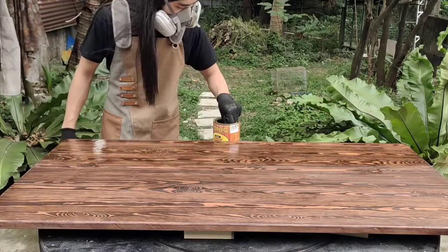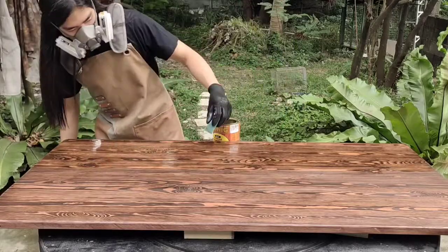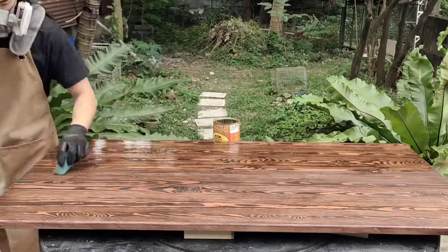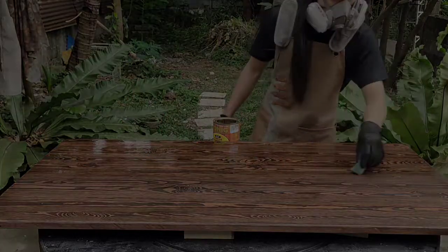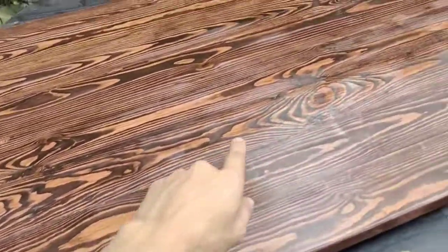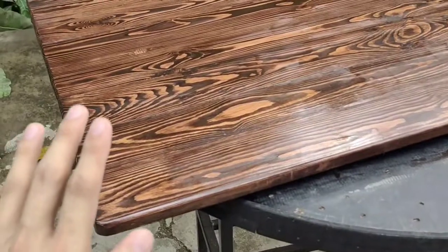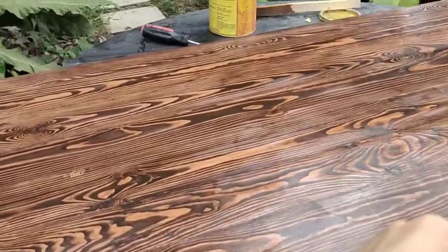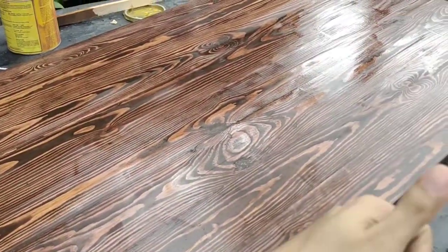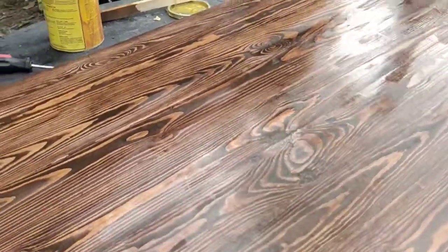I've finished with my first coat. As you can see, no smudges — no stain came off upon applying polyurethane with a sponge. So sanding and not going above 180 works — yes, yes, yes.